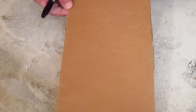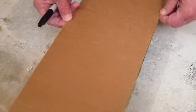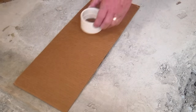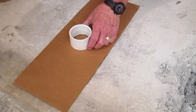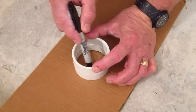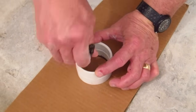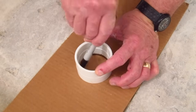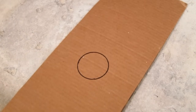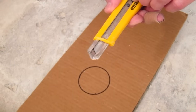Well, I can do the same thing with a piece of cardboard. I cut a piece of cardboard that is far bigger than the hole I'm going to create in the concrete. I take the two-inch coupling and center it up and down, left and right in the cardboard, and use the Sharpie once again to trace the inside of the two-inch coupling — because that represents the outside diameter of the plumbing pipe. Then I use a razor knife and carefully cut out the outline of that circle.